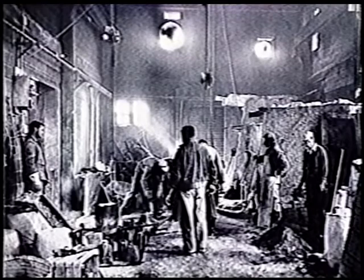After the wax is melted out, they cool it, they turn it over upside down, and they pour the bronze in. Now, the purpose of the vents and the gates is to hold that inner core in place so it doesn't slip down, and let the gases escape, and everything fills in. All right, there's a closer, clearer picture of the investment molds. They're very, very heavy. You see here on the left, that's molten bronze there. This is a finished full-size Cheshire cat in the tree.